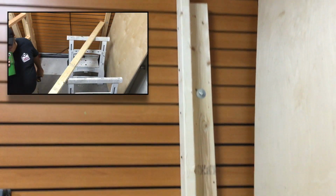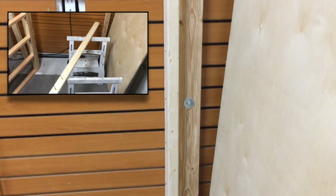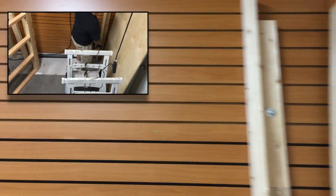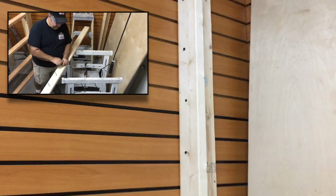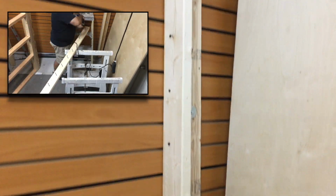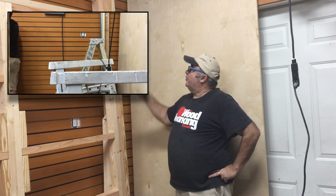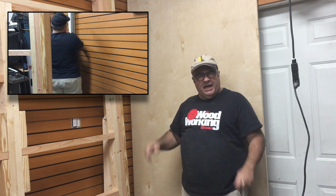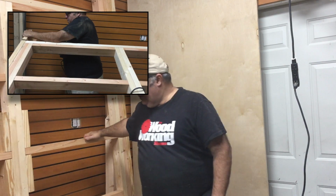As you see, I've started by lag bolting the 2x4s to the studs on the wall. In my particular case, they're 5 studs apart or 80 inches. Then I created an L by putting another 2x4 screwed into the side. After assembling the frame and then putting up the rails to the specified amount, giving it probably ½ an inch on each side, here is my contraption.